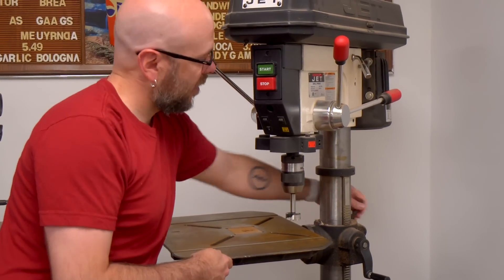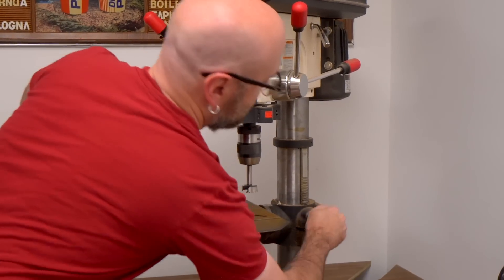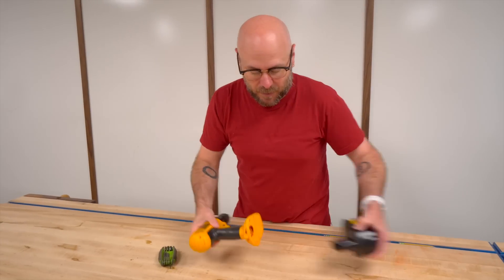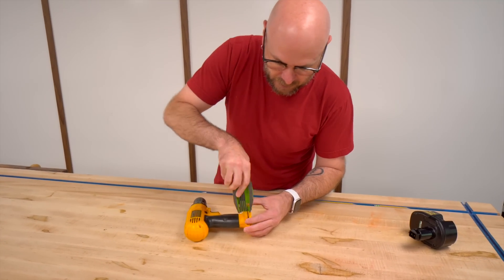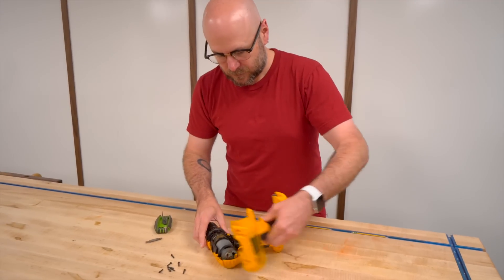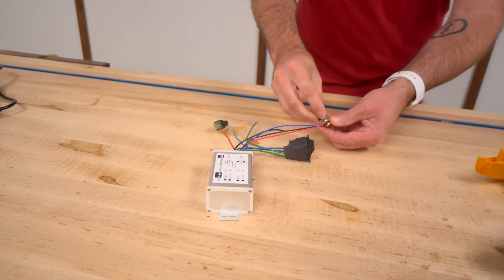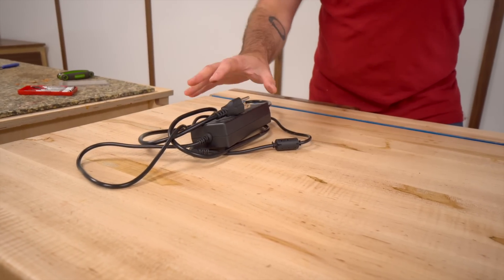It's got a lock on one side and a crank on the other side. The plan is to get a drill attached to this with a forward and reverse button out front. I'm going to take apart this old DeWalt drill and attach a PWM device to it to use the motor. The motor inside this drill is a DC motor, so we're going to hook a PWM up to it for forward, reverse, and variable speed — plugged into the wall. What comes out of the wall is AC and needs to be converted to DC.